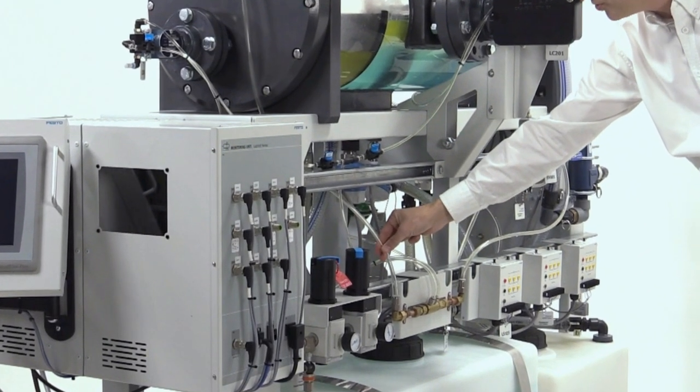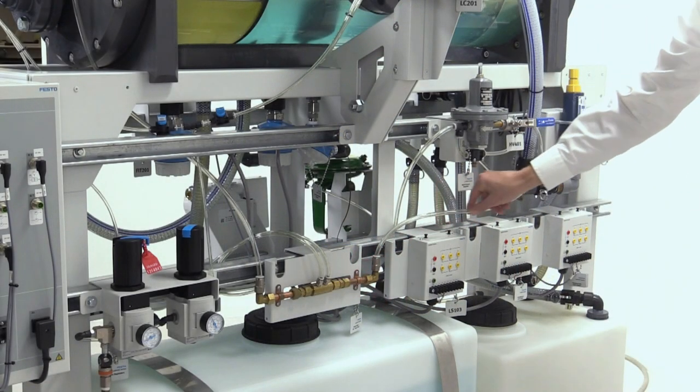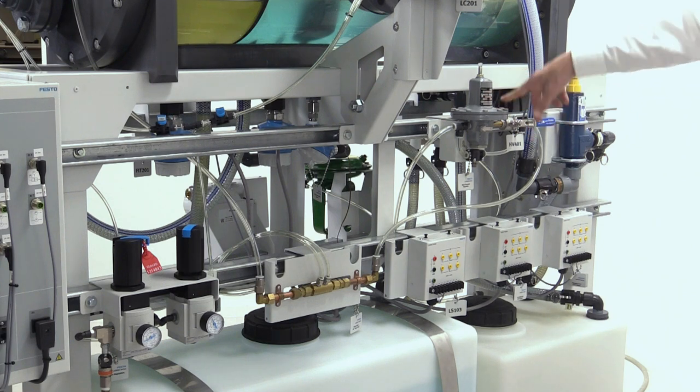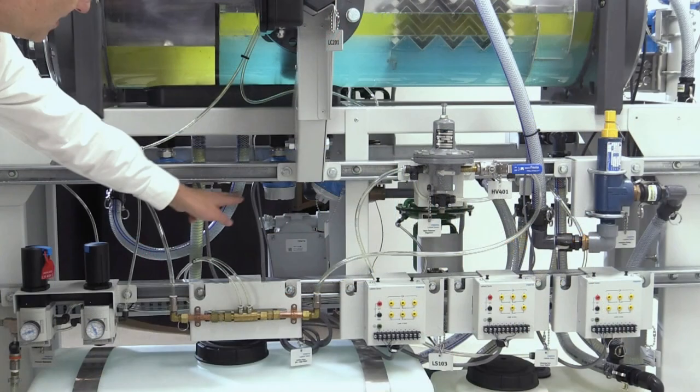Other valves are hidden throughout the system to induce several faults in order to test students' troubleshooting skills. Gas flows out of the vessel through this tube; flow rate is measured by an orifice plate using the differential pressure across the pressure tappings. Gas will then flow through a back pressure regulator, which maintains a constant pressure in the separator vessel to make sure the pressure does not exceed limits.